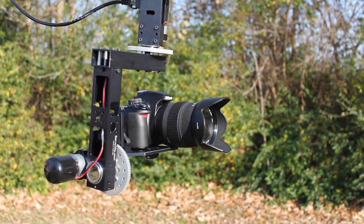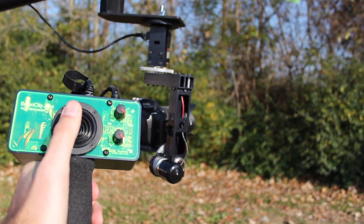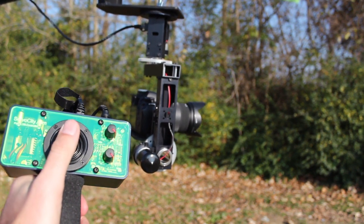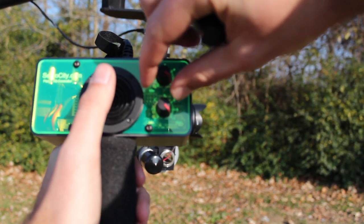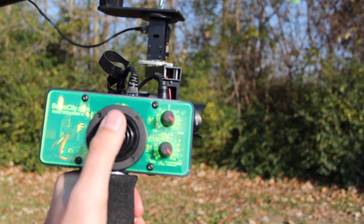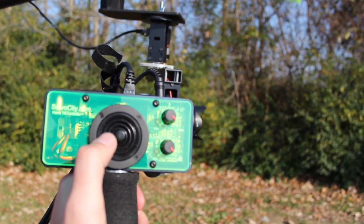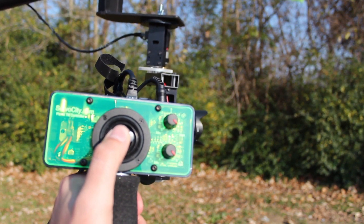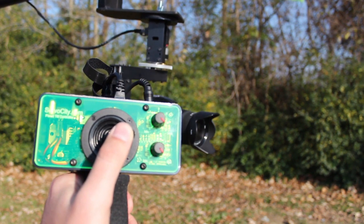So that's the head — let me show you the joystick. I've got my controls set so that left goes left, right goes right, up goes up, and down goes down. It has adjusters right here where you can turn the dials to set the speed of the pan tilt motions. It requires 12 volt power so you can run it off your car. It's a variable speed joystick, so applying very little pressure barely moves it, and applying more pressure moves it faster.